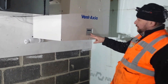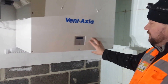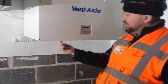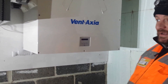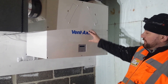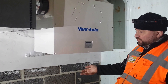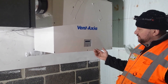There is a control panel on here. In this particular application the client doesn't want the additional control. We do have a data cable which connects into the system and duplicates this control so we can have it elsewhere on the job. Usually these units are put in a roof space, so we have to have another controller placed somewhere — either in a kitchen or a plant room — somewhere accessible that the client can see what's going on, and for ease of commissioning too.